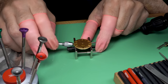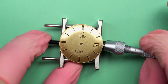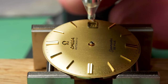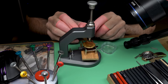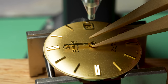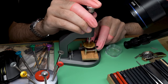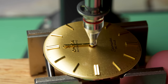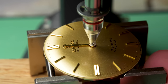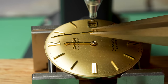In order to set the time I'm going to use a pin vise because I just can't get a grip on it. I'm going to move it right until there — that is right when it became the 15th, which means it is midnight, which is exactly where I'm going to put the hands at 12 o'clock. That way when the watch turns over midnight it's exactly when the calendar will go to the next day so it remains accurate.